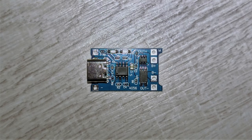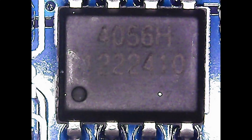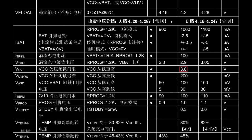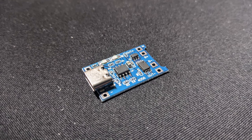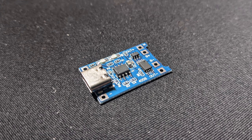The last board is similar to the previous one but has no marking on the back side. It uses 4056H as the main IC, which is a knockoff like TC4056A but optimized for 3.8V batteries. It uses DW01-A for battery protection and an 8205A dual MOSFET. I used this board for about a month and it performed well even with 3.7V batteries.